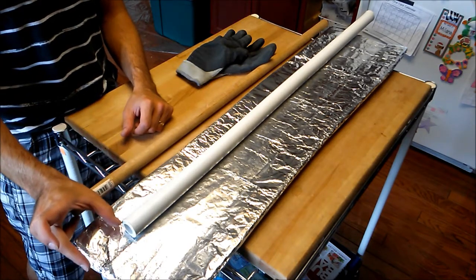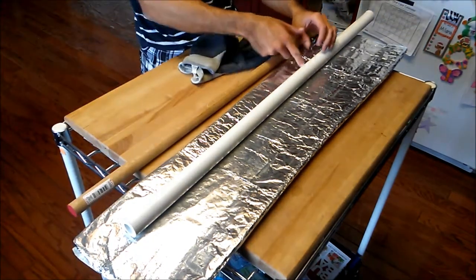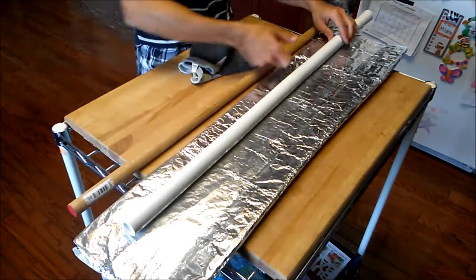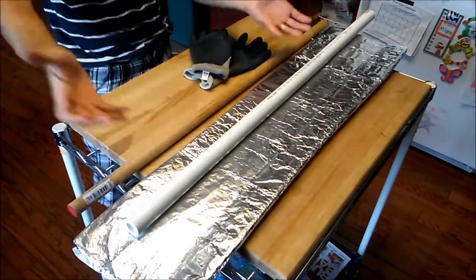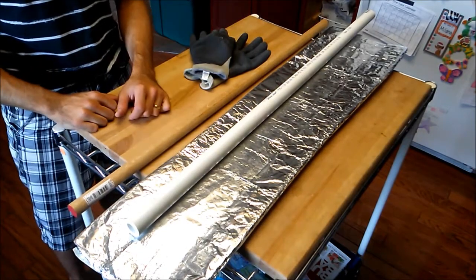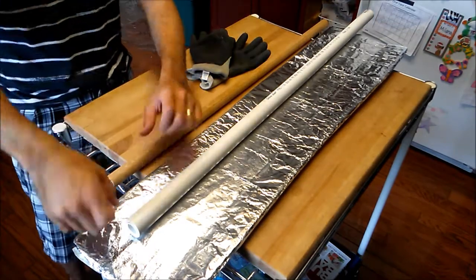When it came down to the last 3 or 4 inches, the strategy I employed was heating the end till it's soft for about 3 to 4 inches, and then the amount that I wanted to drive it in, and then heating the entire thing all along the perimeter, just to help it expand and soften a little bit, hopefully not enough to also soften the inner core. Once that was done, I was able to get it in, like I said, to the last 3 inches maybe. At that point I couldn't drive it in because I couldn't grab it enough.